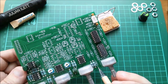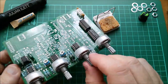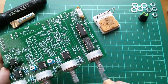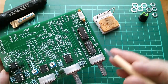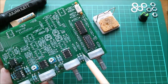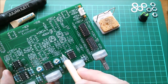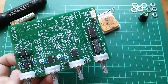There's a little audio mixer here — basically three resistors that pick off the two oscillator signals from the two level pots. This is one of the level pots; the other is underneath and not fitted, so I can probably only have one oscillator coming in. The missing resistor R24 picks off the signal from the noise generator level pot, so I'll need to fit that resistor. That puts all three signals into a 741 op-amp, and we can pick the sound off at R26 where we should hear the combined oscillator and noise signals mixed together.